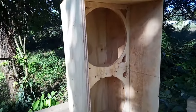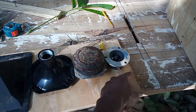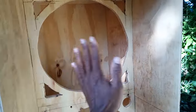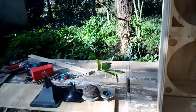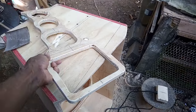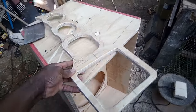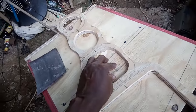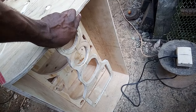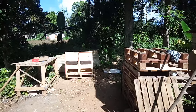This is how the horn and tweeter line is going to look in the front of the box. I'm gonna cut out all these holes to fit them in, spaced as close as I can, so when I put it in front it gives the 15-inch room to breathe while playing. This is the piece of rail that's gonna be in front of the 2x15 — here is one horn, here is the next horn, tweeter, tweeter — like this into the box.